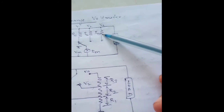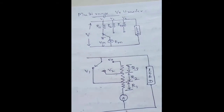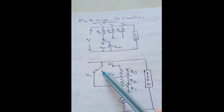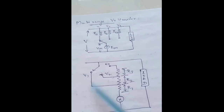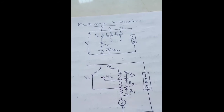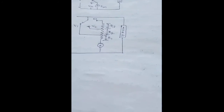Using different resistors may increase the cost of the instrument. To eliminate that problem we go for a potential divider arrangement where we have a single resistor directly connected in series with the meter. This single resistor has different tappings and the switch will be in contact at different tappings. Depending upon the position of the switch at different tapping levels we can have different values of voltages, allowing us to measure multiple values of voltage using a single instrument.